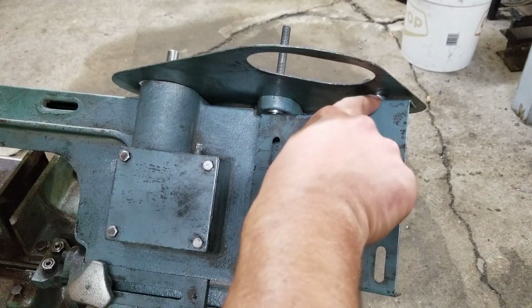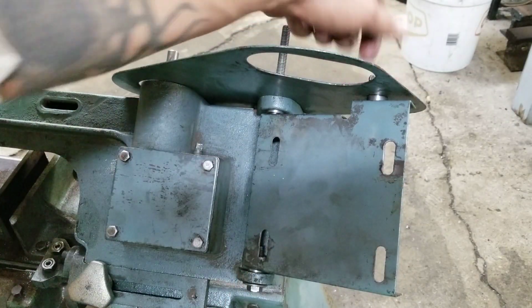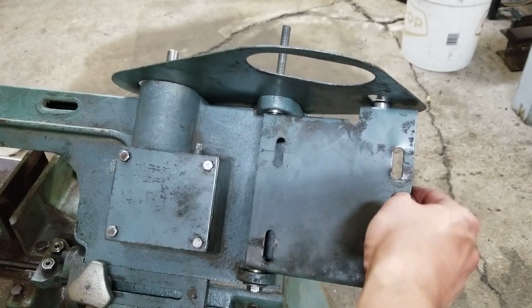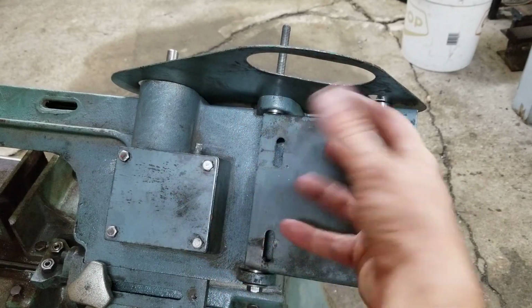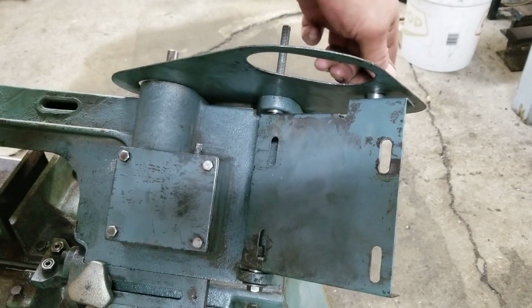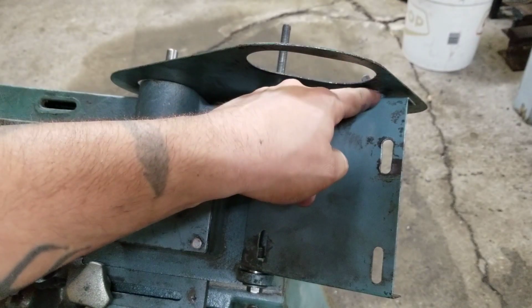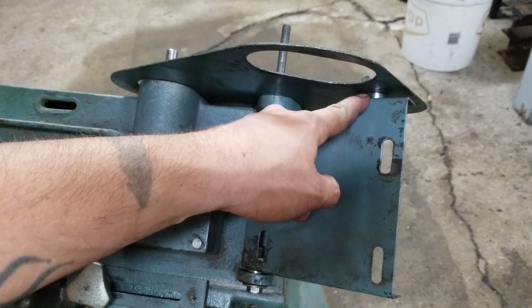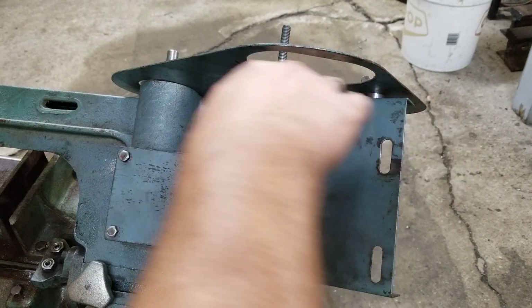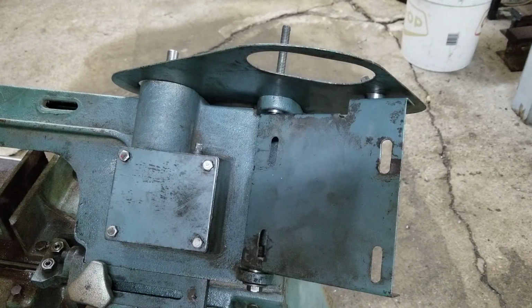But yeah, and I made a bushing for up here too. So now with the bushings installed, when you gotta adjust the motor, there's none of that. Like this was up and down and flopping around every which way. But that should work, and now just a simple washer. Well, I had to make a weird kind of fitting right here to account for the carriage bolt. Plus now it's also nice and square. I don't know how the hell they were running this thing before. To be honest, it's ridiculous. Crazy talk.